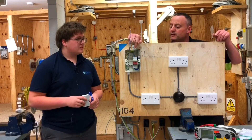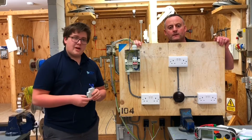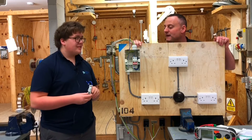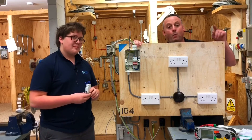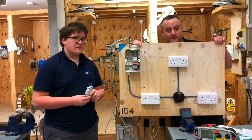However, the device we're going to fit in here is a combination device. What are you going to fit inside that consumer unit? An RCBO with an AFDD in it as well. And it's rated at how many amps? 20 amps. So we're going to be fitting an arc fault detection device onto our A3 radial circuit.